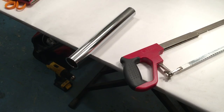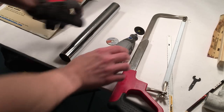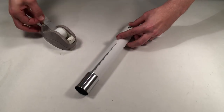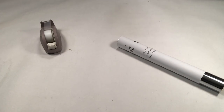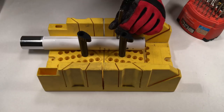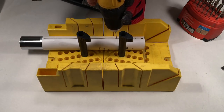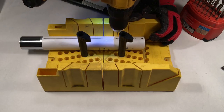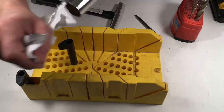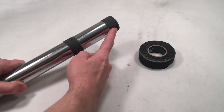To simulate the MPP flash tube, we will be using a 1.5-inch sink tailpiece. Trim off the flange with a hacksaw or Dremel metal cutting disc. This rough area will be hidden, but if you have super rough edges, they can be sanded down with coarse emery cloth. Affix the MPP flash template to the sink tailpiece. Simply align the top of the template with the clean end of the sink tailpiece. Using a center punch, tap a groove into the center of each hole. This will help prevent the drill bit from slipping when drilling through a metal cylinder. Start with a small bit and gradually increase the bit size to get the desired size. Using some friction tape, make about 3 or 4 rotations around the sink tailpiece. It should now have a snug fit inside the 1.5-inch PVC pipe.